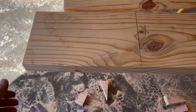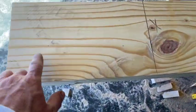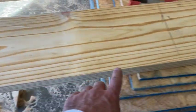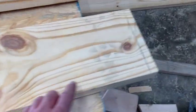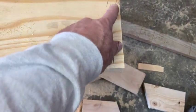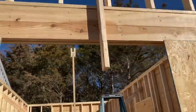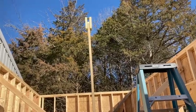We laid out our ridge board crown up. This is our 12-inch overhang off the front of the building, and then we start with our first rafter here at 24 inches on center, down to 10 foot, and then we split it right there. We'll have a set of rafters split on that. We've got these boards set up to hold our ridge in place for 10 foot.